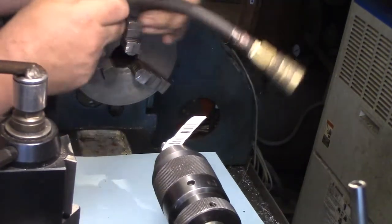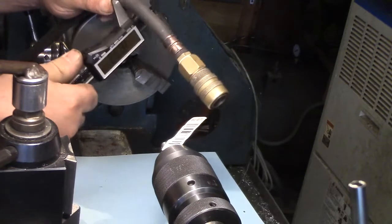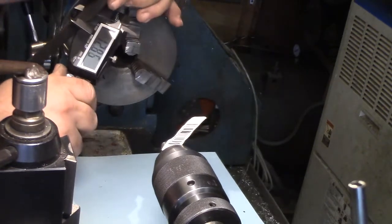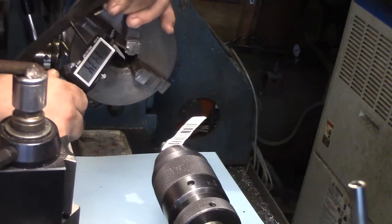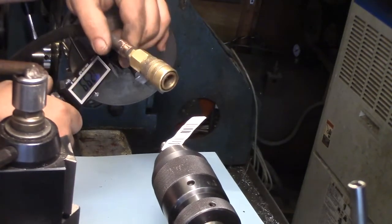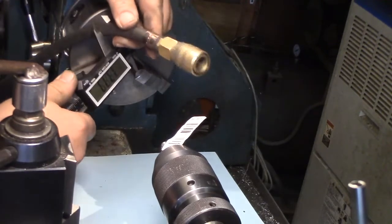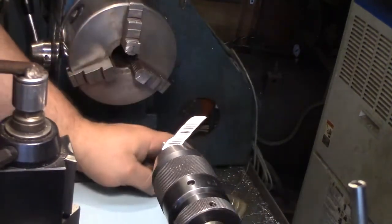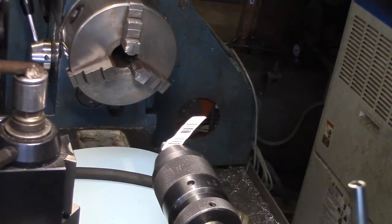So this hose, while it's got air compression in it, comes out to about almost 13 millimeters. So I guess this would be considered a half inch hose, but it's not half inch ID. The OD was about a half inch. So you can't use half inch squishy bits because they're actually 7/8. You know, that really drives you mad, don't it?